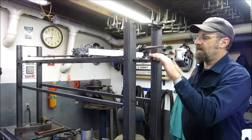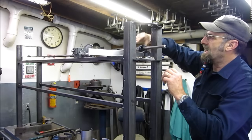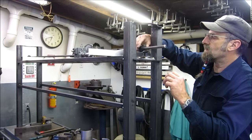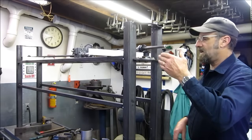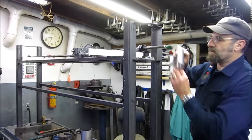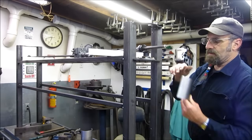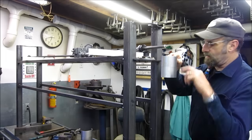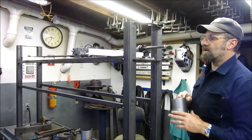Alright, we got the bearing in this plate here, we set this up in the hole pattern and we're looking good. We're planning what angle this is going to go in relationship to the plate, then we're going to weld the half rounds onto the disc and take those at the right height, poke them in, and put the bearing bore for the other gear.